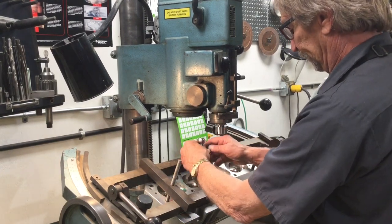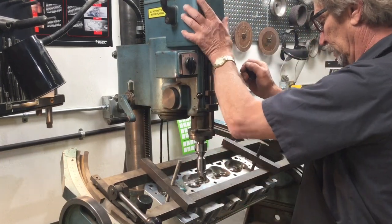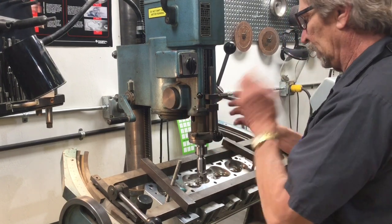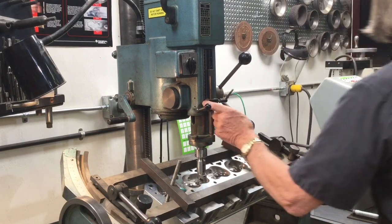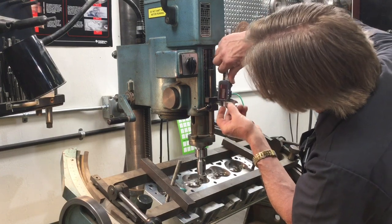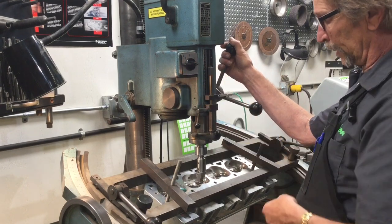I get my bounce spring, bring my head over, and line everything up. You've moved the head, so you've got to reposition and lock it back into position, making sure you've still got nice movement. Always like to float it a little bit more one more time. Then make contact and set another quarter-inch depth increment — 250 thousandths right there — and lock that down. Remember, if you're not measuring you're just guessing. Unlock the quill, turn it on clockwise at second speed with the pilot in.